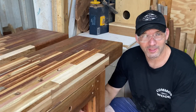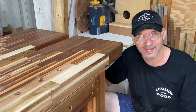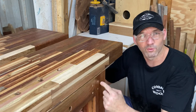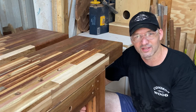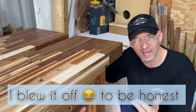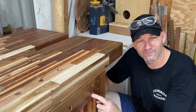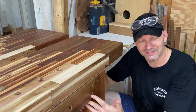It's also confession time for me. Now, when I built my table, I built the two end pieces first, so it was easy to handle and I had the workspace to do it. I then did the glue up to get the long sides glued in. So these pieces with their mortise and tenon, I didn't do the draw boring technique because of the amount of pieces I had to do in one go. It was a little bit overwhelming, so I just relied on the glue of the mortise and tenon, came back and doweled later, fogging up. The keen eye would have noticed early on, I actually put my dowels through this side where there is no tenon. Anyway, you know what I'm going to say, I'm a dickhead.